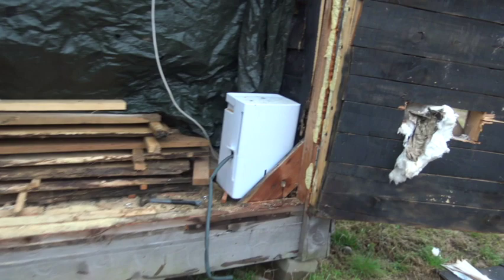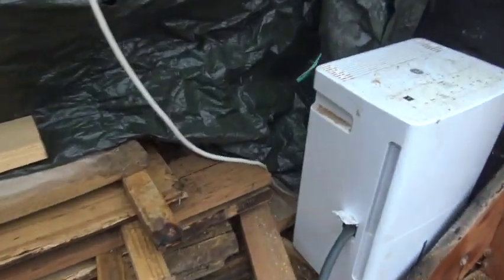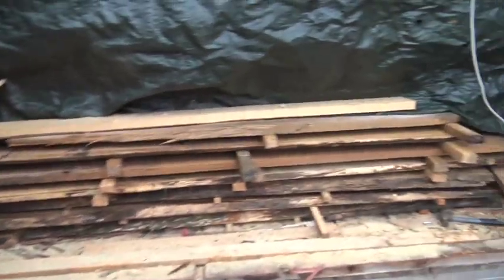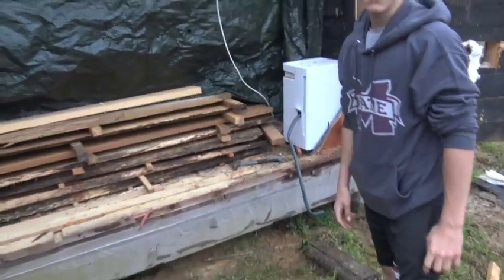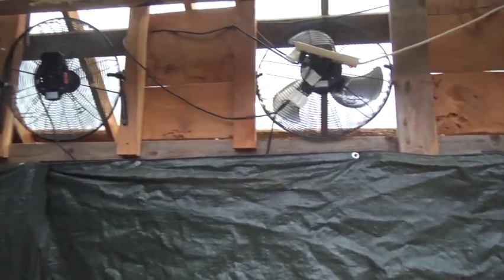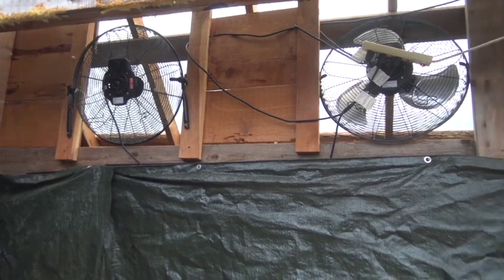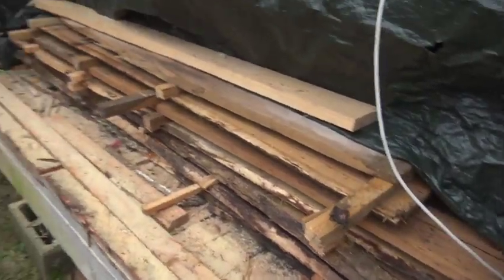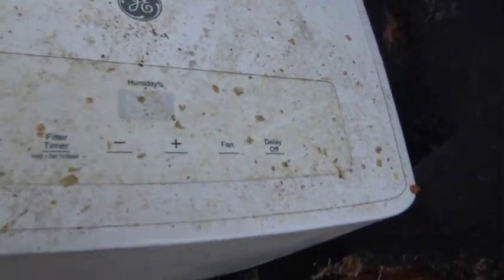You can see what we've got here — we try to make it as airtight as you can. We obviously have a few gaps, but you want the air to blow through the other side and come through these slats. This thing seems to work pretty good. My middle fan is not working, but I've got my two outside fans on low — that'll be enough. I don't want them on full blast right now because I don't want to dry it out too quickly, which causes cracking and warping. I'm also going to turn the dehumidifier off for now.